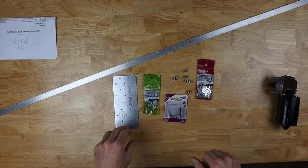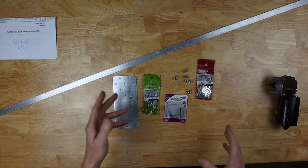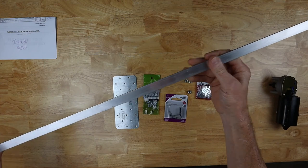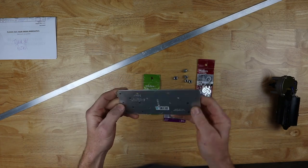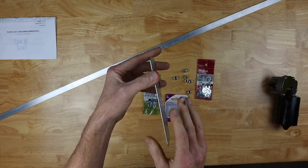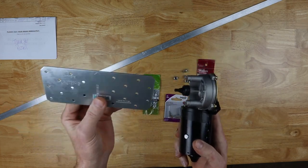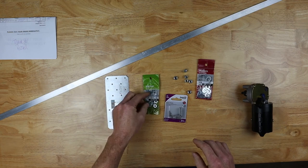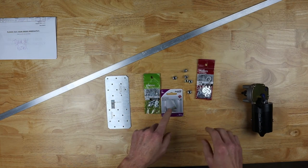In addition to the parts from Monster Guts, you're going to need just a little bit of hardware for this project. I got all of this stuff at Lowe's — tried to use stuff that's commonly available at Lowe's, Home Depot, or really any home improvement store. I've got a piece of aluminum bar that I'm going to use for my push-pull to attach to the rocker and to the motor. This is a strong-tie piece of strapping material that you can buy — it costs about a dollar and something — and I'm going to bend it into a 90-degree angle so I can attach my motor to it as my motor mount. You can buy mounts for these motors online, but they're like $10. This costs less than two dollars and I think it's going to work fine. And then just some quarter-inch machine screws and nuts, bolts, lock nuts, a little L-bracket to attach to the chair, and some washers.